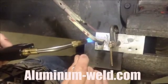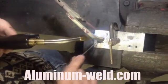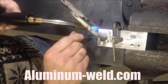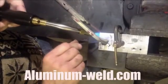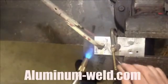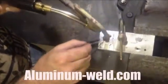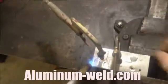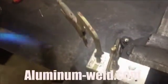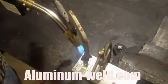That's why you have that oversized hole. It's really important you let the aluminum get hot enough to melt the rod — it took me five minutes to get to this point. I bought this product from aluminum-weld.com. The video will be on their website as well as many other instructions such as bolt drop, butt joints, and so forth. I'm going to overfill this hole with the rod and we're going to let it slow cool.